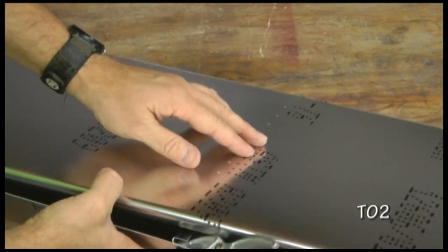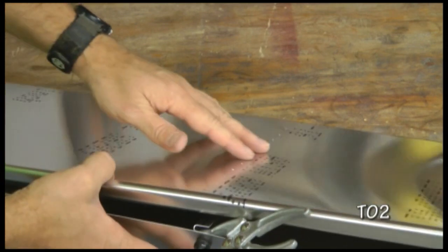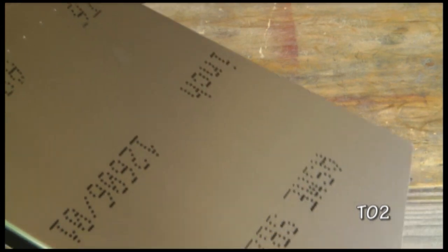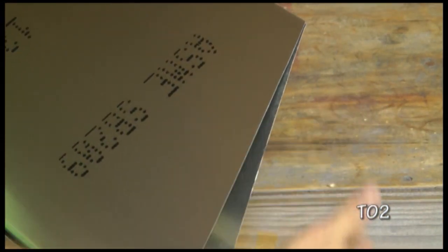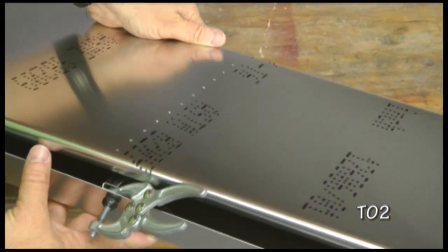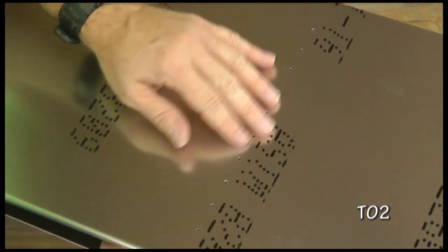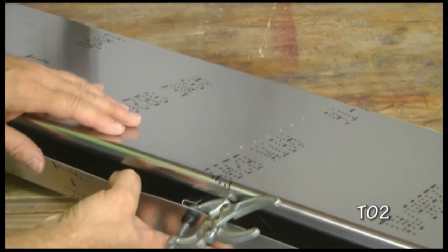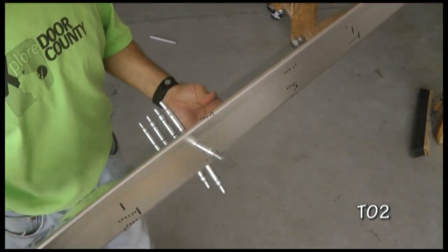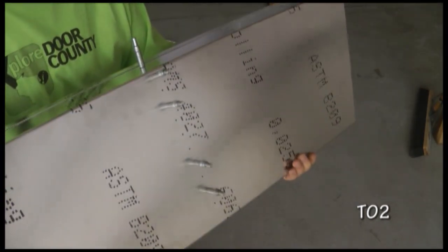And if you have trouble, once you close this up, take the clamp off with the cleco and close it up, and if you need to move that rib and you're having a little difficulty, remember you can always come into the edge and push with a long object like a hinge pin in order to center the rib and find the line prior to drilling and clecoing. Now here we see that I have finished drilling and clecoing the rib on all three sides.